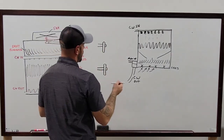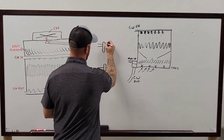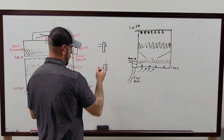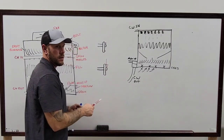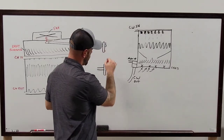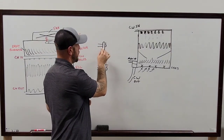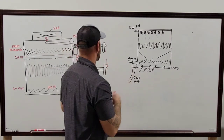Yeah. Okay. On the one alignment tool that you have, we put those little magnetic tabs on both sides of this here. And then you have your main laser shooting off this way towards the other shaft. So when you're setting these, set one of them first, but pay attention to where both shafts are. A lot of the time, the shafts won't be directly across from each other. The motor shaft should be sitting way back here, but your blower shaft is so long that it doesn't matter having to pull this all the way back that far.